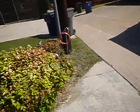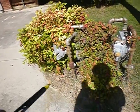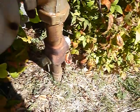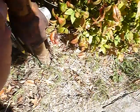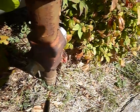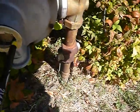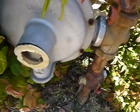This is the gas meter. I can't really see where it goes into the house — it goes in from this side somewhere, under the ground. The pot is high enough off the ground. This is how you would turn the gas off if you had a gas problem. If the valve is parallel, the gas is on; if it's perpendicular, the gas is off. And this vent cap — like the neighbor's vent cap over here — the vent cap is missing; it actually kind of just broke off.